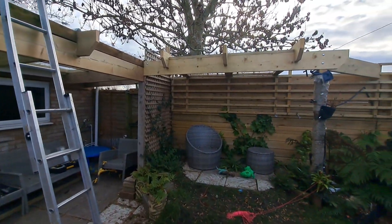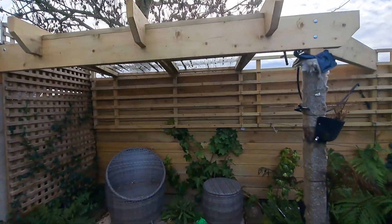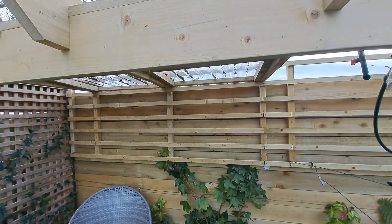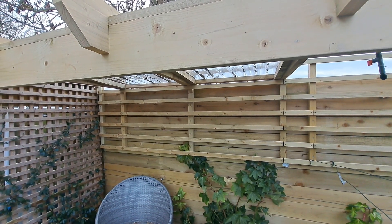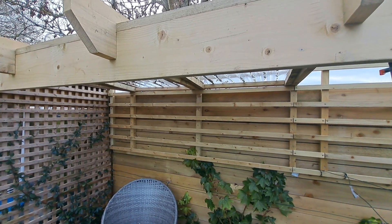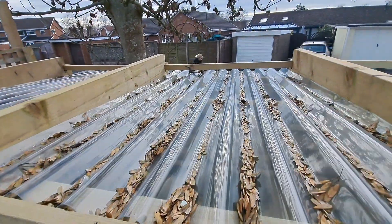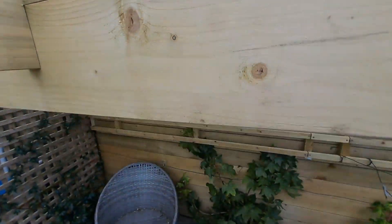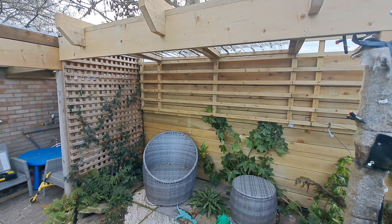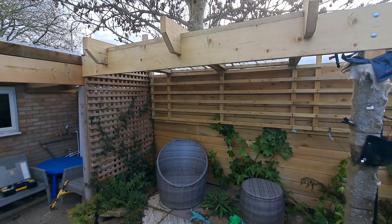The next video I'll do a final reveal, but I've got a few snagging bits to go through now. This thing leaks like a sieve — that's because some of the screws I've used big metal washers instead of rubber washers and I forgot to put silicon under the metal washers, so water gets in and I get a few drips when it rains. But that's dead easy to fix — it's nice and accessible. I'll just get my silicon gun, pull them out, put a bit of silicon underneath and dab them down, then go down the edges of that one.